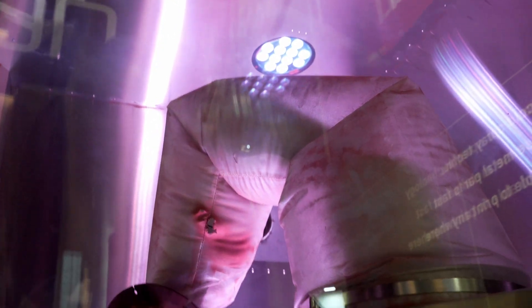What kind of material properties do you get out of this process? The general spectrum would be castings on the low end and forgings on the high end. We're typically between those two, a little closer to the forging end — generally better than a casting, but not quite as good as a forging.